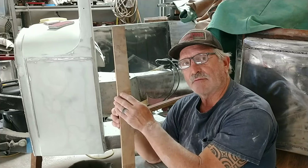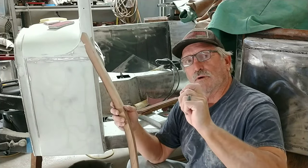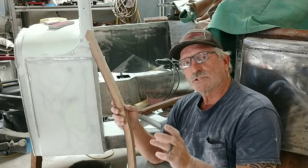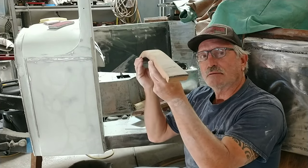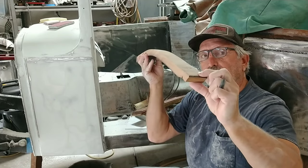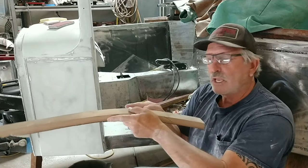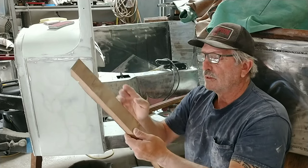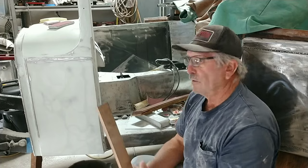What I do is I'll take a quarter-inch board, maybe six inches wide or whatever, and I'll start out with that and lay the stave on the quarter-inch board, clamp it on each end, and then run it through the table saw — which squares that edge up. Naturally I do both sides.